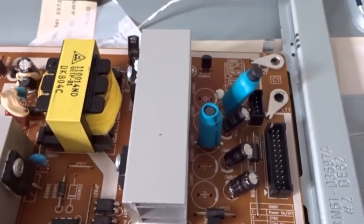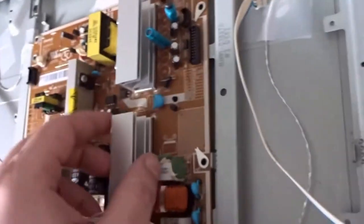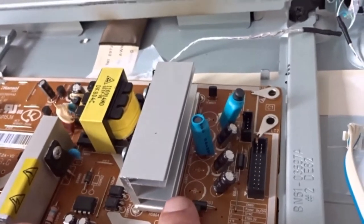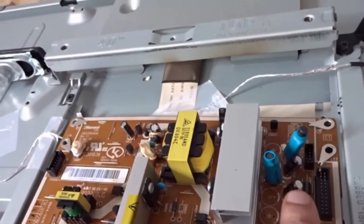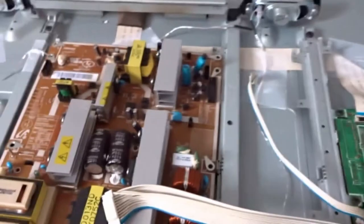All four of those caps were completely bulged out and absolutely destroyed — they were leaking out at the top. Part of the fault with these boards is there's so much heat coming off the heat sink, even after only five or ten minutes, that the heat pushes straight onto these capacitors. When I solder them in, I'm going to lean them over to the right a bit to help keep the heat away from them. On the back of the case, just over where this problem arises, I've drilled a set of holes to go straight over the top of the problem area so there's some ventilation getting to it.